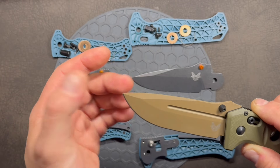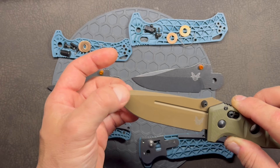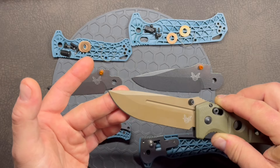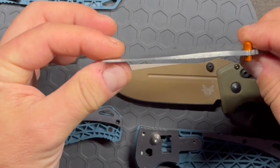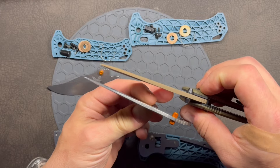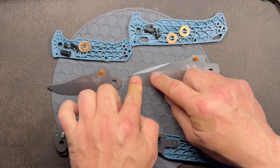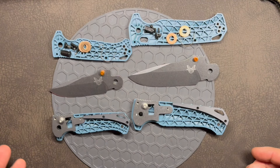Now let's talk about the swedge — this is something I don't like. The purpose of the swedge is to create a diamond-shaped cross-section at the tip. A properly executed swedge brings several lines to a point and terminates at the blade tip. That ridge creates additional stiffening more efficiently than simply making the blade thicker and flat — it's akin to the ridge on top of a construction helmet: it absorbs and distributes stress from striking while maintaining excellent penetration capability.